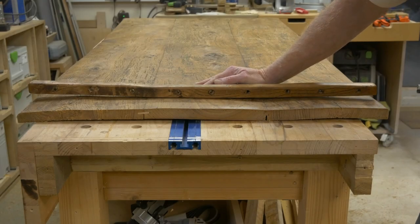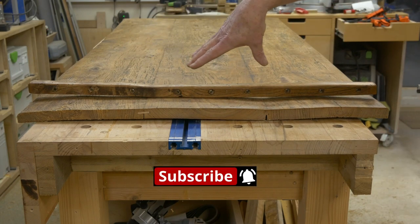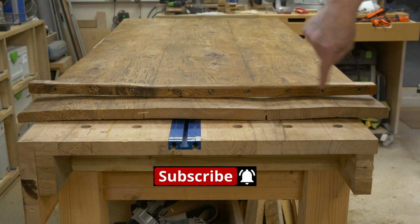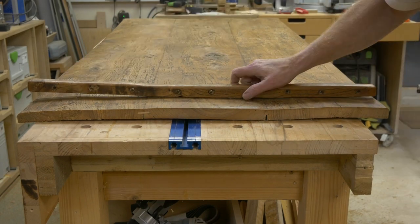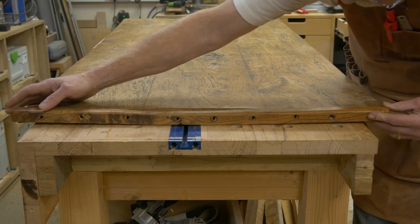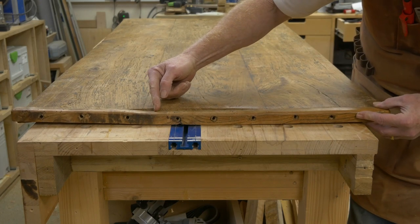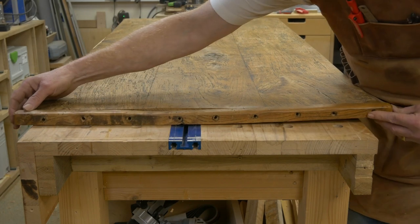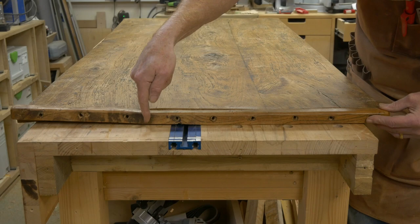The last challenge is to refit the breadboard end. But the breadboard end was glued, so it's warped to match the end I've just cut off — and it's a completely different profile. There's a lovely curve there, and a lovely curve there, and a lovely curve there, and the breadboard end is totally different. The only idea I've got is to put a small cut there and use the Japanese hand saw to cut it because it's really, really thin. I've got no length at all to play with, so if I put a cut there and then angle it slightly...